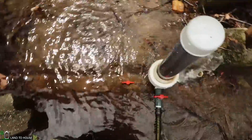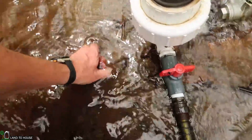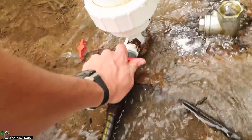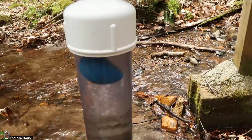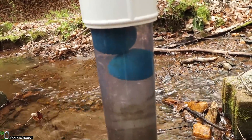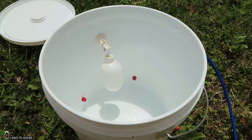Currently the ram pump is filling tanks at the top of my hill, so let's go ahead and turn that off down here with this valve. Now let's turn on the valve going up to our new tanks. We're right at the pressure where the racquetballs are wanting to inflate and deflate. Let's turn on the chicken watering bucket first. We have to let all the air out of this pipe — there's a good bit in there. You can hear it cycle at the pump.